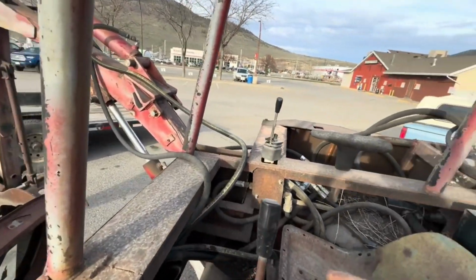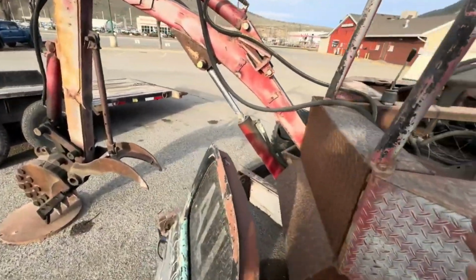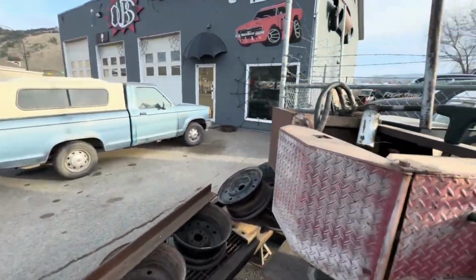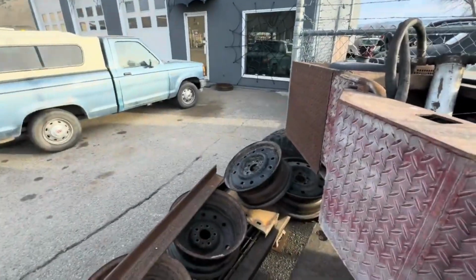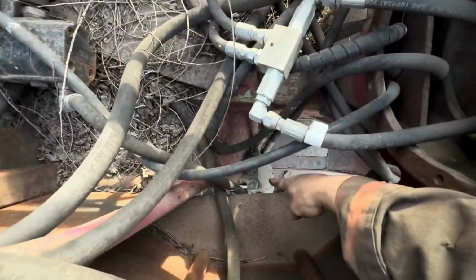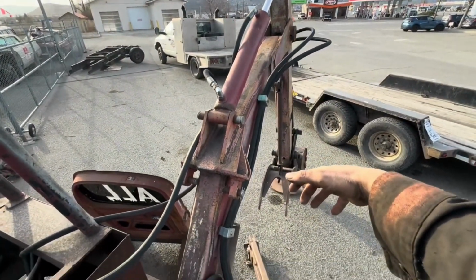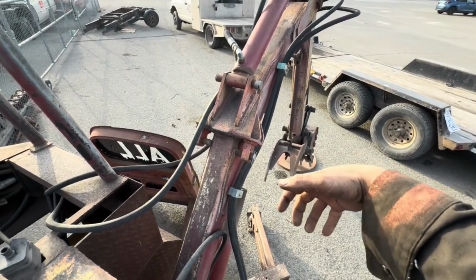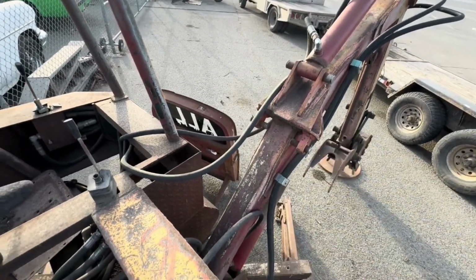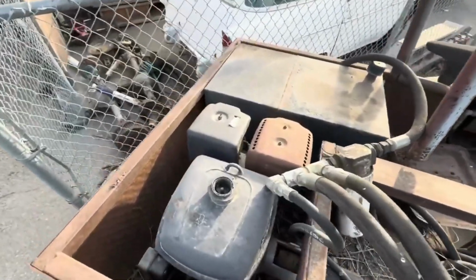I did buy 2 buttons for up here because I have split the flow of the hydraulic fluid in half. So half of it goes to the swing and to lift up the boom, and the other half goes to the bucket and the stick. But I've always wanted to be able to divert flow to one side or the other. So yeah, there's my diverter block down there. But it would have been sweet if, say I was pulling into a stump and I hit a big root, I could push the button, divert 100% flow, and give me more power to push through. I always thought that would have been sick, but I never got it on. But I still have them, so it's not too late.